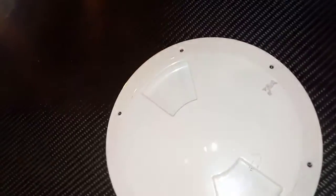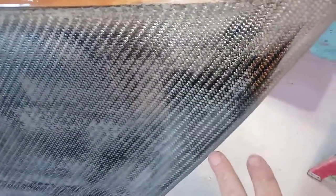You can't see it through here because of the extra partial bulkhead I installed, but I also installed an extra piece of reinforcing wood inside the bow so that later on, if I want, I can put a u-bolt through there to attach a hook for a trailer or something. I haven't fully decided on that yet — it's very practical so I'll probably do it, but it doesn't look as nice. I just made provision for it while I had access.